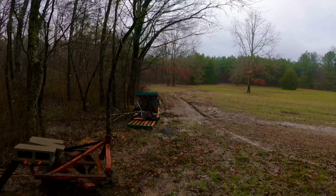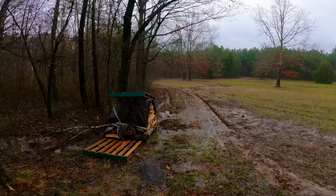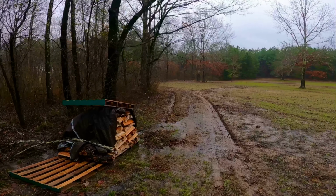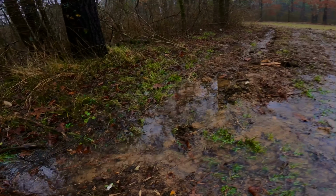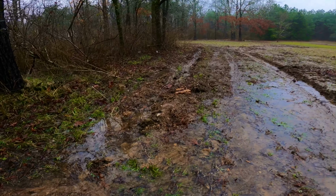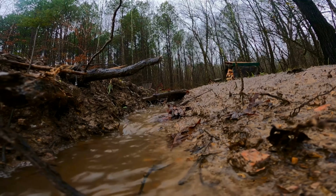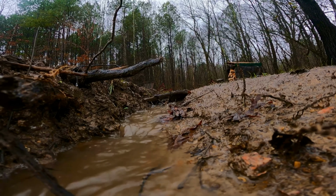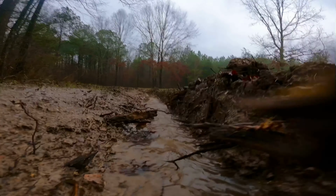Our trenches appear to be working well, however I have learned that I need to move the firewood rack further up the hill as the water comes gushing out underneath it, and I need to bring the primary trench further back to catch that first line of water. Most importantly though, the water coming out of the woods is going into the trenches, and it is going all the way around the garden rather than right through the middle of it.